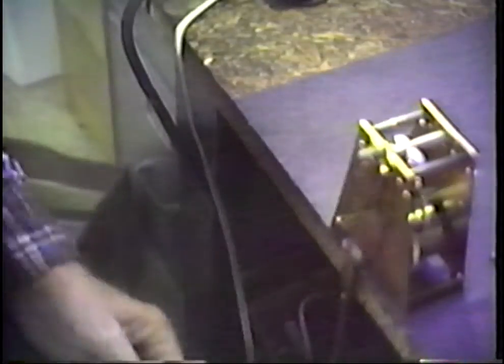While we're talking here, in just a few moments, let's see what this is reaching now. We were a scant 1 1/4 inch, and at this point it's about 1.55 inch of swing. A very healthy swing. We have a very good recoil on the escape wheel, and this movement's taken quite a bit of work here in these clock talks in the last couple of days.